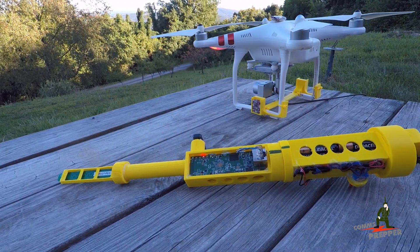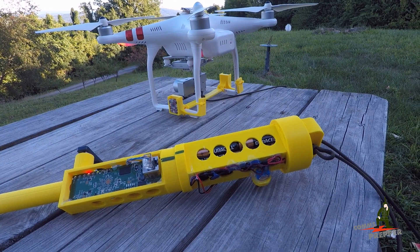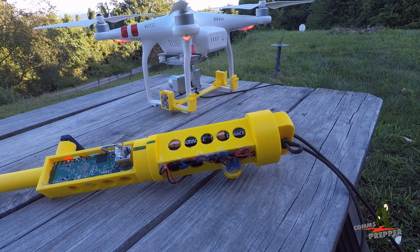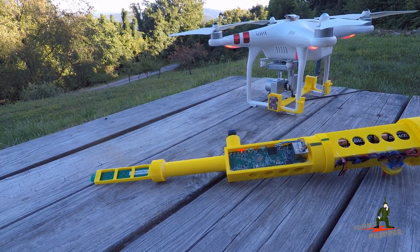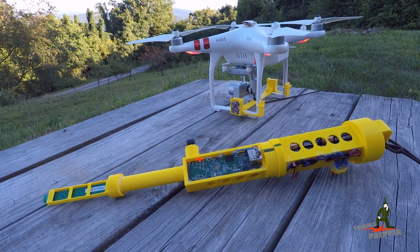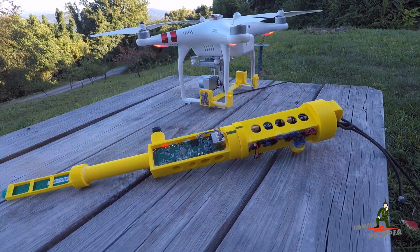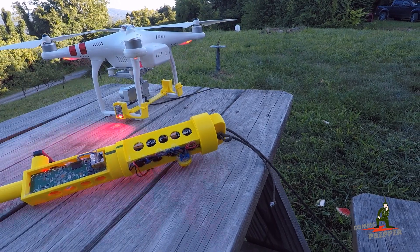I think the unit is still a little too heavy. Right now I'm using eight alkaline AA batteries and I think I need to change that down to AAA batteries. That might be enough to power the node because I was only able to get 12 minutes of flight time in. To provide some vertical separation between the radios on the drone for flight control and video feed and the node itself, I have 25 feet of 550 cord.